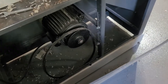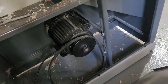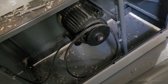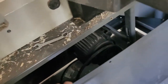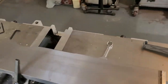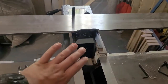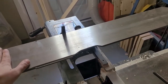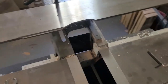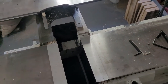First off, in order to get everything undone, I came over here, I loosened off the bolts of my motor, lifted it up, and I removed the pulley system from the cutter head itself. In the manual, it says you have to disassemble your entire fence, remove it and everything else like that — that's not the case at all. If you slide it all the way back and bring the fence parallel up to the actual bed, you'll have plenty of room to get things out. And as long as you've disconnected your pulley, she'll come straight out.